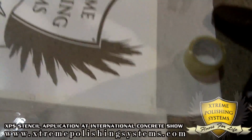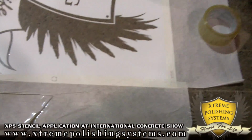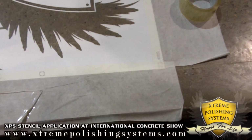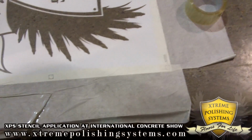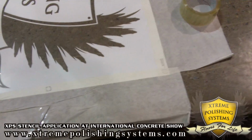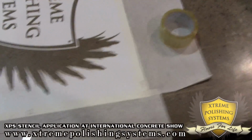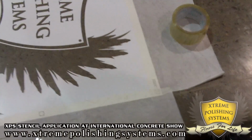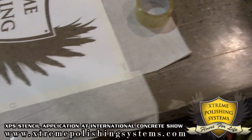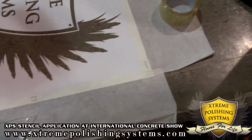Yes, if you're pouring a new floor, you want to use densifier, definitely. Even when you don't polish, it's good to use densifier. Like I said, it closes the pores and seals the concrete below the pores, and it stops the dust from coming up. So the floor will be harder? Yes, it hardens the floor.